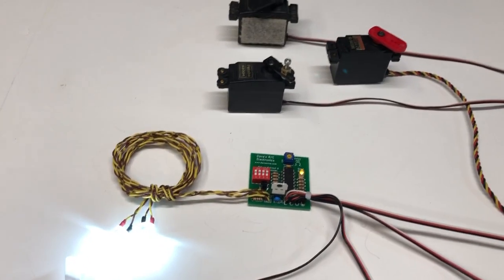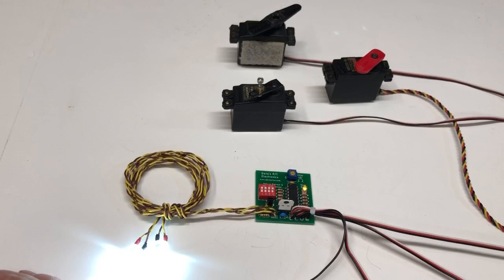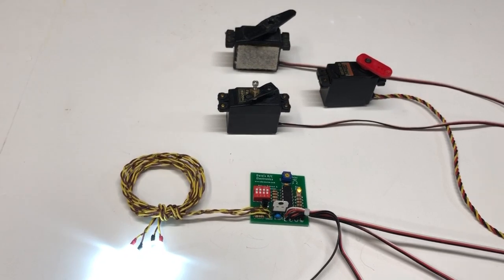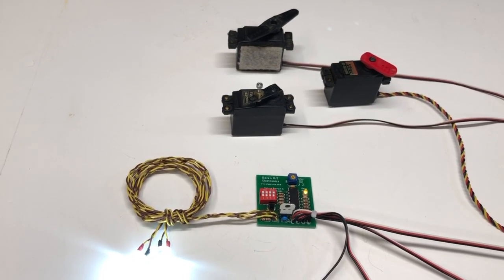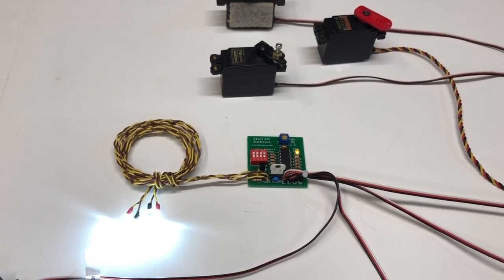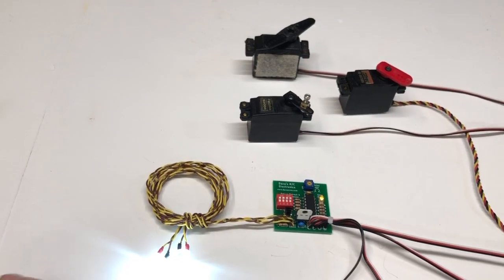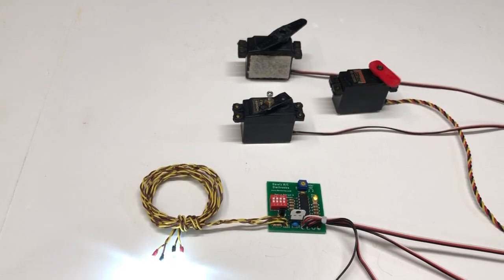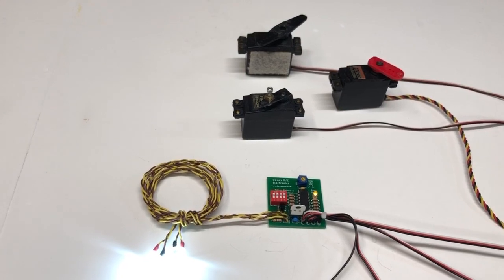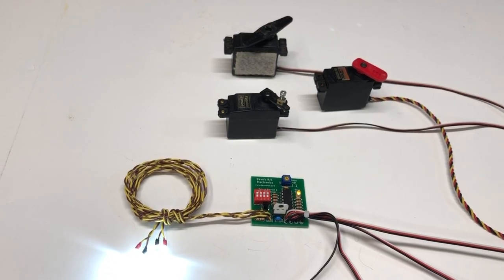Now, we're geared down now, so let's say we take off and we give it gear up. The aft door opens, the gear comes up, and they start up, and wait a minute, I need to land again. Gear comes right back down again, and after the full amount of delay, you will see that the aft door closes and the lights stay on because we're back to gear down. So it's designed to allow you to reverse the action as quickly as you need to. You see how we can almost instantly bring the gear right back down again in case of, say, your motor quits or something happens and you decide it wasn't a good time to take off after all.